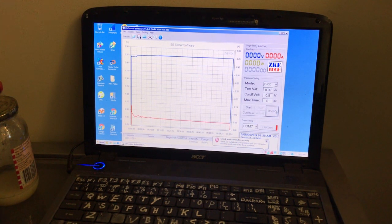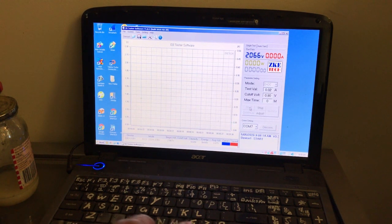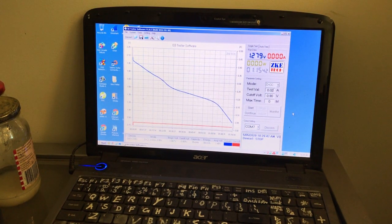Disconnecting the charge. With the 2-volt charge it's staying around two volts, whereas I think the last test we did was 2.1. Starting our test. Slightly better: one hour and 15 minutes. We got 26 milliamp hours and 38 milliwatt hours out of the manganese dioxide cell with activated carbon.